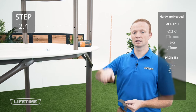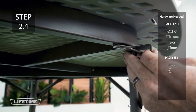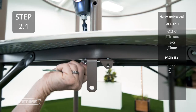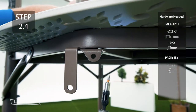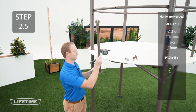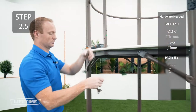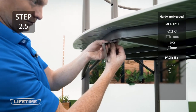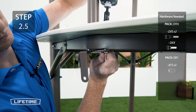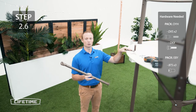Before you attach the bottom of the rail support to the deck, make sure you add your brackets so that they're oriented like this. Repeat the previous step for the rail support on the left side of the pole with the warning label. Similar to the previous steps, add the remaining rail supports into the cutouts, except you're only going to add one bracket instead of two.